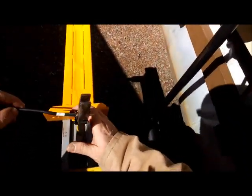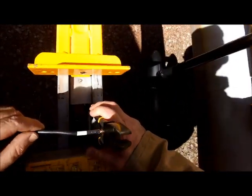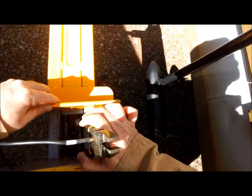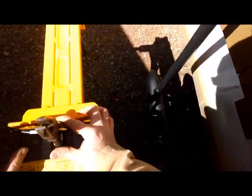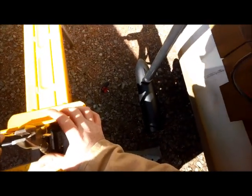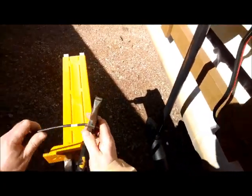Because I can't squeeze it myself, I have this jaw horse that I'm using. I line those handles up right along this bar — that helps keep it straight. Watch your fingers if you try doing this. I'm going to line this up, put it on lock, and then put my foot in here — that's how a jaw horse is designed — and slowly press with my foot until I can feel it give.